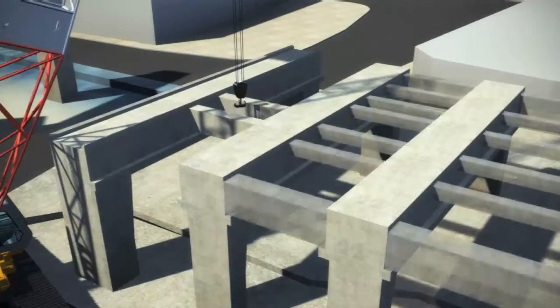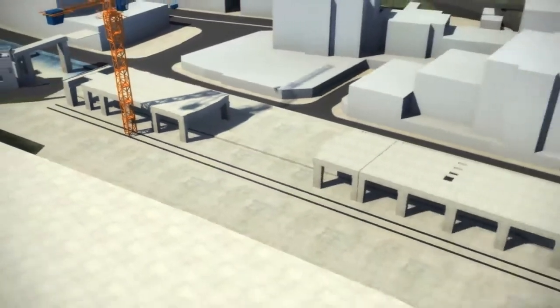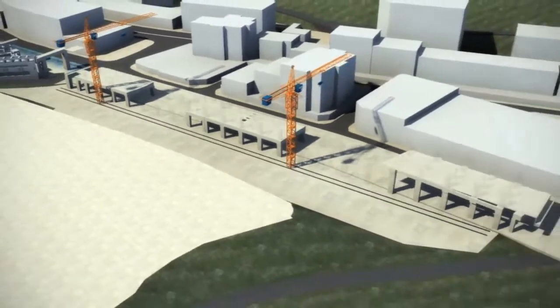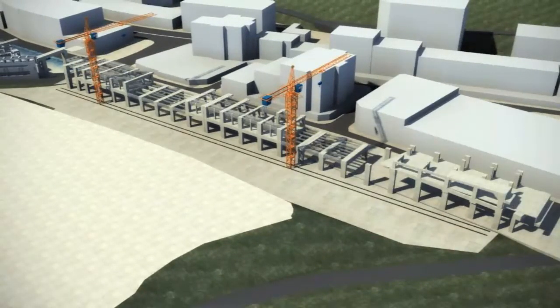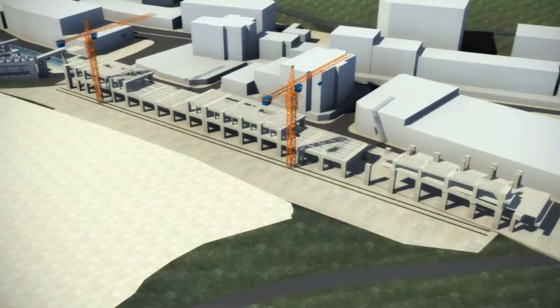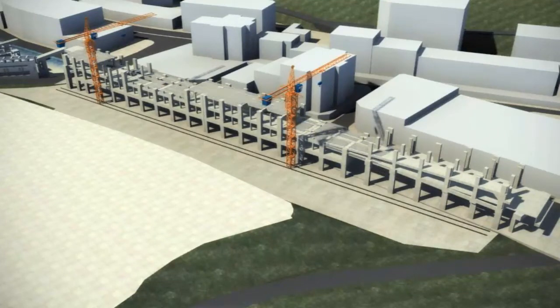The main and secondary beams will use precast U or L shells. This will reduce the on-site concreting and associated traffic by approximately 800 truckloads, with follow-on benefits for safety and community impact. Further benefits of the precast solution will be reduced falsework and risks associated with working at height.